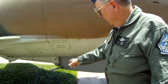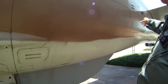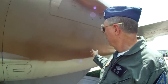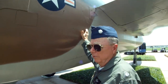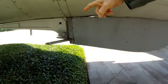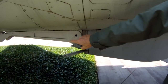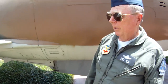This is the original drain for hydraulics and fuel. The fuel tanks are in the fuselage — all of them are in the fuselage. It has dry wings; there's no fuel in the wings. So if you had a leak back there, it would come out of this hole here — that's a drain for the fuel tank, and this is another one for hydraulics and fuel. Right behind that is the tail hook, or where it would be — this airplane doesn't have one, but that's where it would be for engaging the barrier, the old MA-1A barrier.